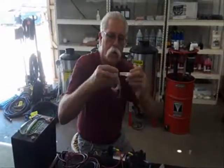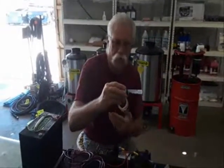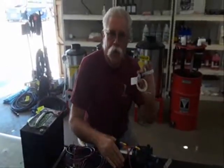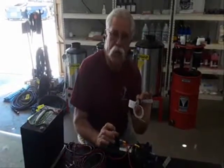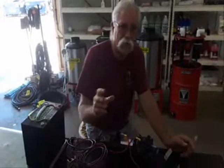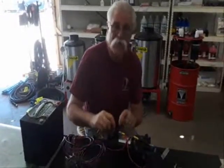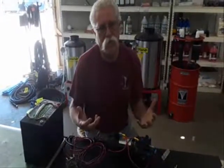When the level comes up, it opens the circuit and turns this thing off. When the float comes down because you're using chemical out of your holding tank, it turns this back on and refills your tank for you. This is simple controls, but you've got to understand how they work. Control your relay that turns on the main power. Use a relay with beefy contacts. If you go and use one of those big solenoid type relays with 100 amp contacts instead of 80, it takes so much power to run the solenoid that you may be starving power to your motor just because you picked the wrong relay. Use these little efficient automotive style relays and your entire electrical system can be more reliable. When you want answers and want things done right, go to PressureWasher.net.